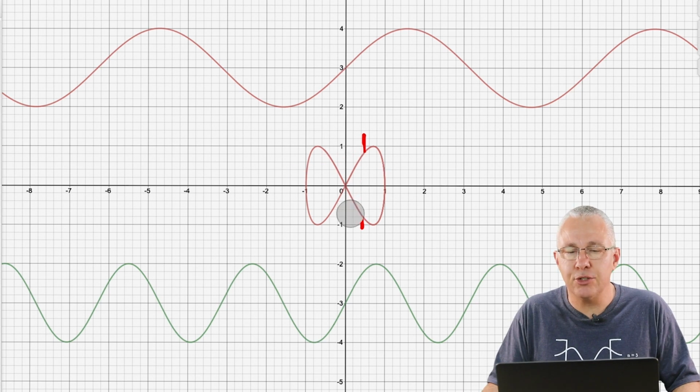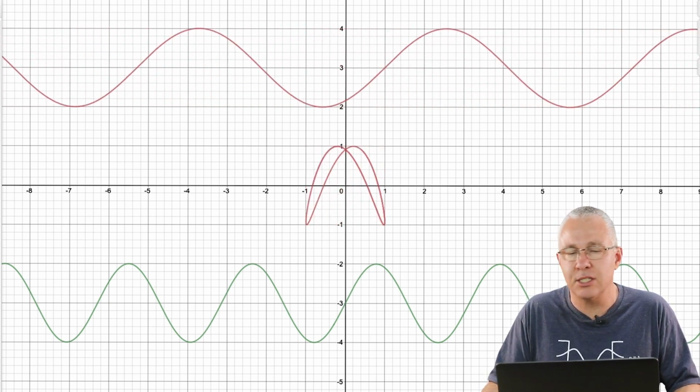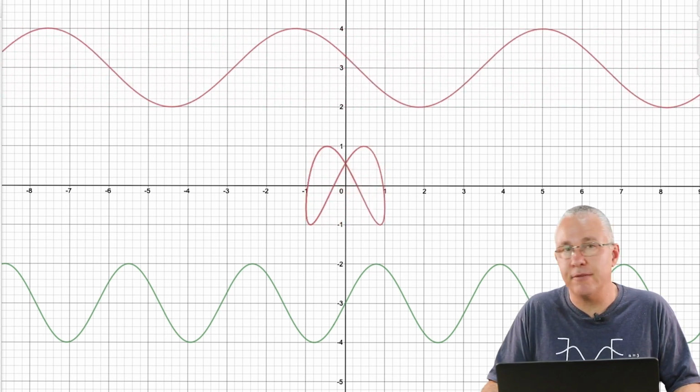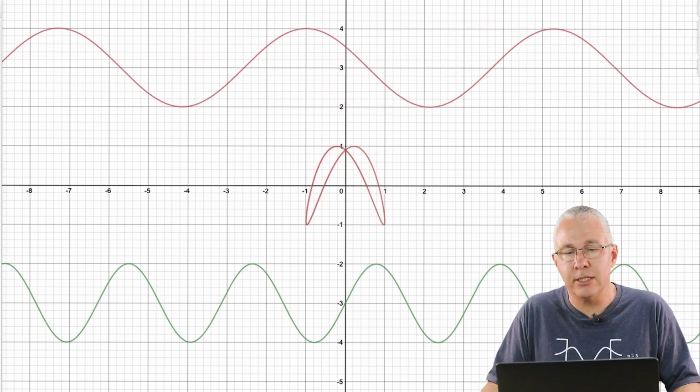If I now were to play that with respect to time, in other words, the phase would change with respect to time, I'm going to get a pattern that looks like this. That relationship of 2:1 with the cutting of the lines is going to stay true here, but you can see now what we're getting is a rotating pattern. And the same is to go if I have a different particular combination. So, for example, I can change our relationship is to 2:3.